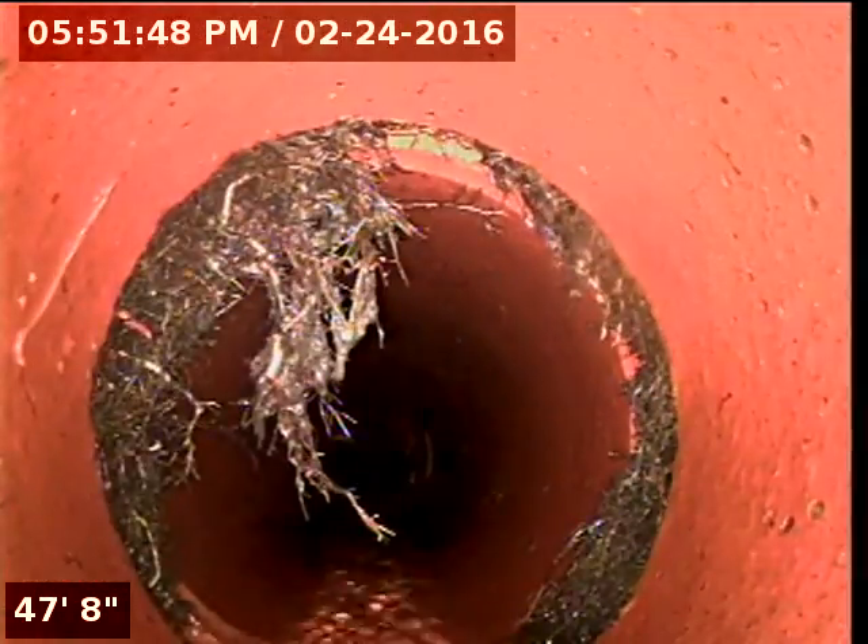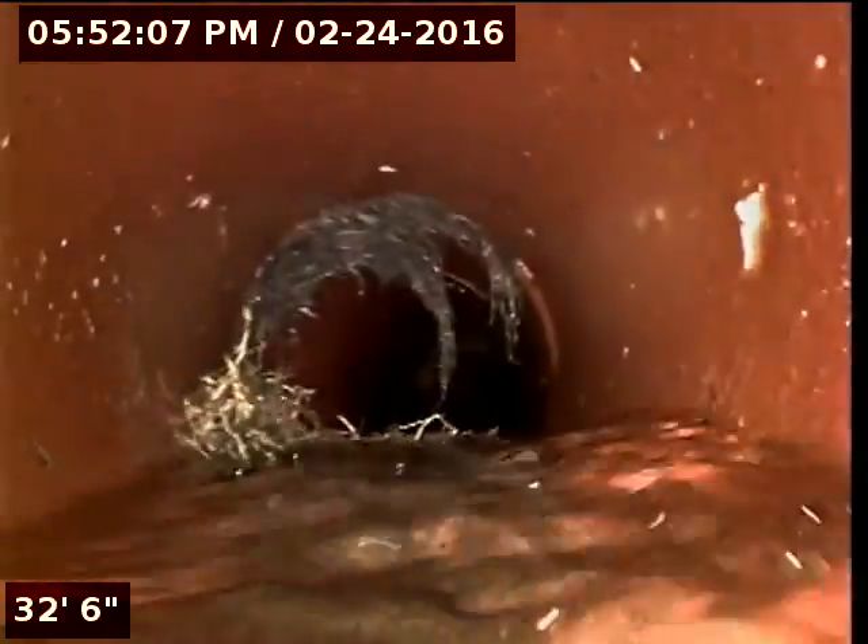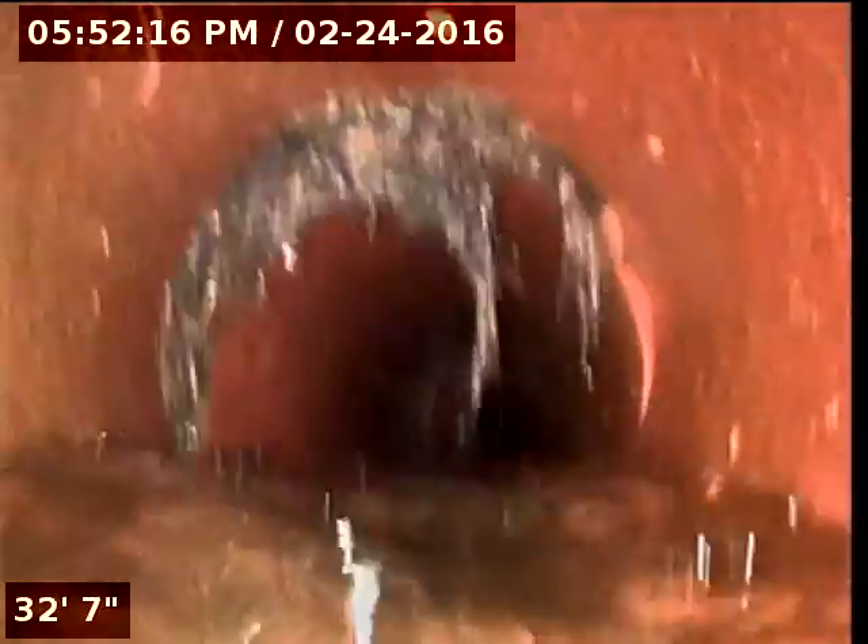You can see it had a heavy root intrusion before and after, and you can just see all the remnants in there. Here's one we saw with some roots still dangling in it — it won't hook up for at least a year. That's just a loose one that's going to float down. There's a little bit of a belly right here, nothing too bad. It's a little low on the sewer and the water's still deep.